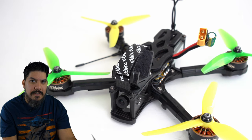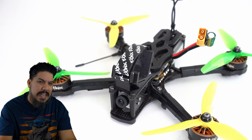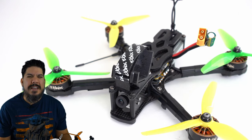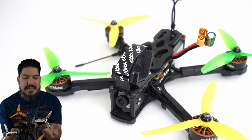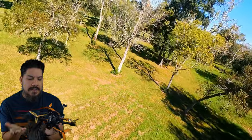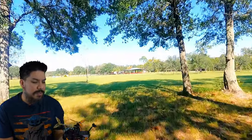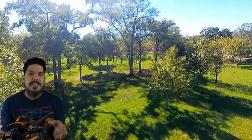So it is definitely heavier than Mr. Steele's formula, and that's why I want the larger motors to offset that. The extra power that you get with this motor just makes the weight of that GoPro disappear. It flies like a dream. I'm basically flying the default Betaflight tune on 4.2 on here, and there's almost no oscillations, almost no prop wash. I mean, I can see why freestylers love this formula. My goodness, the precision and yet the smoothness.